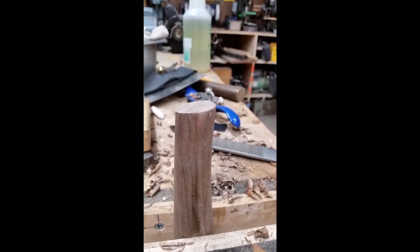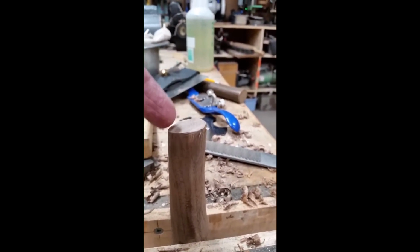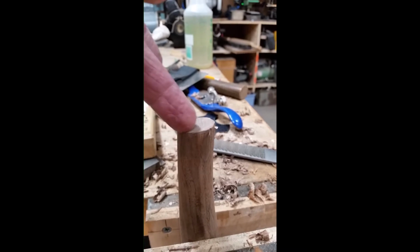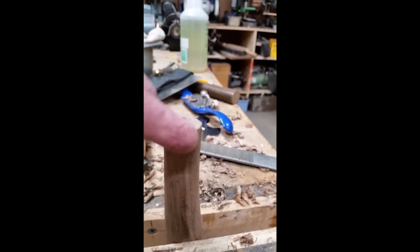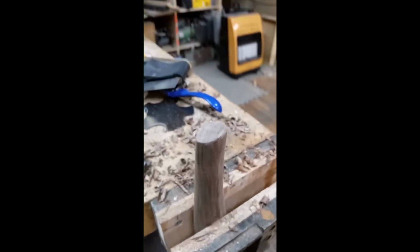So I'm going to take, because it's very likely that any cutting tool is going to pull and chip that out, and I'll lose material and be really short back here. I'm going to use the rasp to clean this up and use the fairly fine area to put a little bit of a bevel. And I'll probably put a little bit of a back bevel this way from top forward to the bottom, right? So it's going to slant down this way, and it gives a little bit interesting look to it.